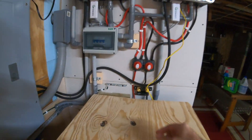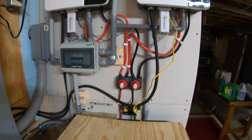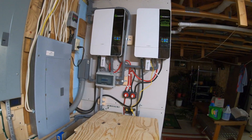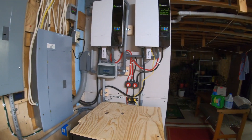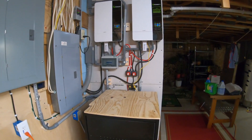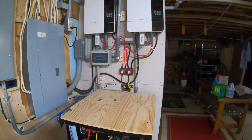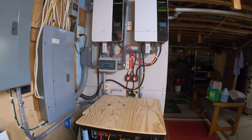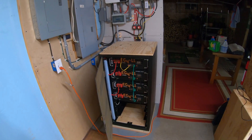I am going to replace the wires coming from the batteries. Even though they're 4-gauge and they're not getting hot, I've watched this system run at 90 amps when charging from the solar panels, with 45–50 amps going out simultaneously. I was grabbing the cables all day one time worrying about melting or a short circuit. They never got hot, but Ian actually noticed in a video that they were a little thin, so I'm going to put in a bigger gauge.